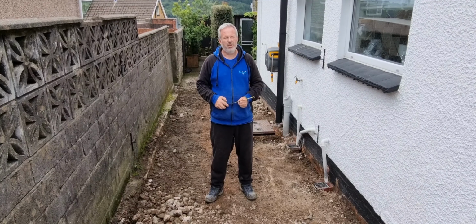But this section coming towards the end of the house here, we're going to have to put this patio in at a separate level, because otherwise if we follow this level, then the clients are going to have a ski slope. They'll be sitting having a glass of wine like that. So what we discussed with them is we're going to put a straight line in the random pattern Indian sandstone here and raise this back section up so it's a proper decent fall for them, and then they'll be able to sit out on their patio without sitting on a severe fall. So just a little bit of thought and consideration sometimes gives a better job.